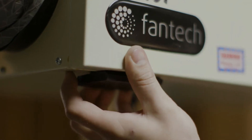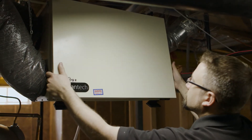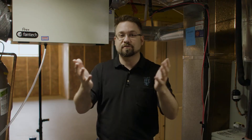At the front of the HRV, along the bottom, there are going to be two black buckles. You just unbuckle these and then the lid hinges up. You can remove the entire lid itself just by sliding it off its hinges, and then you're just presented with the core in front of you.